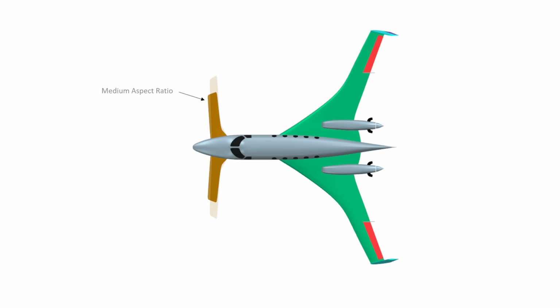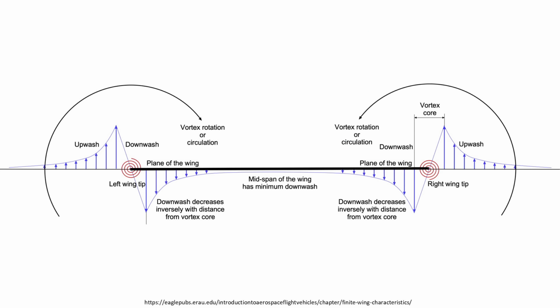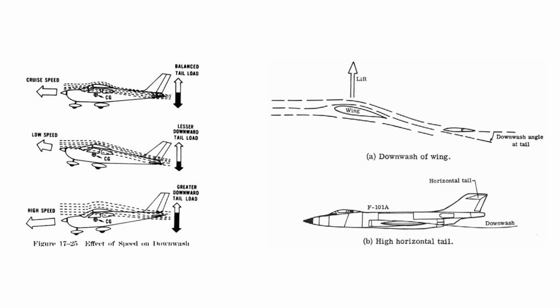Increasing the canard aspect ratio doesn't just help with inducing an earlier stall onset. With higher aspect ratios, the downwash is decreased for the same lift. Remember, we're generating lift more efficiently with a higher aspect ratio. And weaker canard downwashes will decrease the adverse effects on the main wing due to the canard downwash skewing the actual alpha.